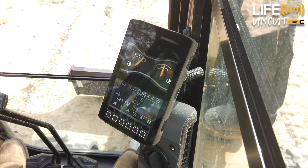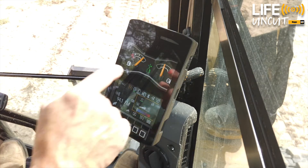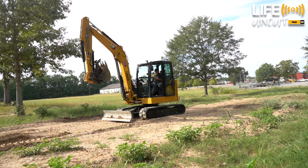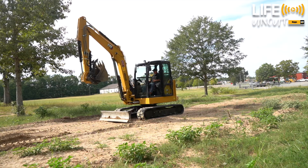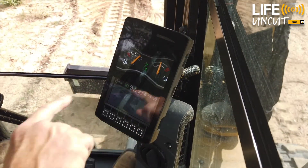Welcome back. I've smoothed back a little bit so I can show you how the cruise control works. We've got to be in skid steer mode before we use it — our icon's already up on the monitor, so we'll go ahead and activate skid steer mode. We've got to have motion before it'll come on. To turn it on, we're going to use the button on the front of the right or left joystick. As we're moving, we'll push the button, activate it, and you see the light turn green.